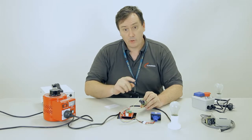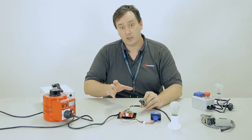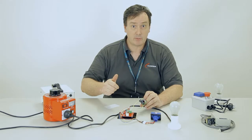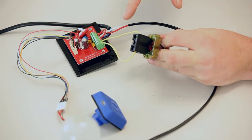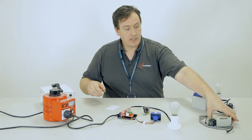However, it's really important that you don't remove any existing e-stop circuit that you have in your wiring. Most of the standards require the e-stop button to electrically isolate the equipment. So in a lot of cases you'll find we give you an extra set of contacts to put onto your existing e-stop circuit, which you then wire into this. And in fact, here's an example of just that.